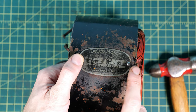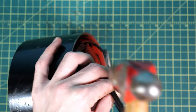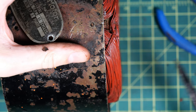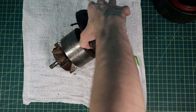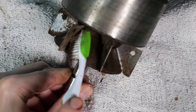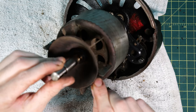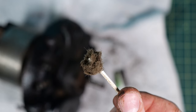It was time to try to remove the tag on the motor. I took a screwdriver, found the back side of the rivet, and tapped out the first rivet. The second one was a lot tougher but I ended up using scissors to wedge between it and pop it out, giving me the nice little motor tag. With the coil clean, it was time to work on the rotor — I took the toothbrush and cleaned every section I could, getting off all the grime and dust. I used ear cleaners to reach inside the holes and those came out with some nasty dust bunnies.